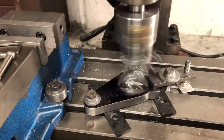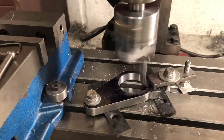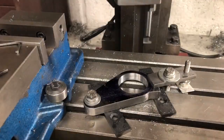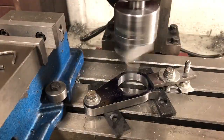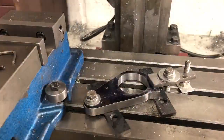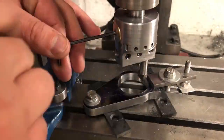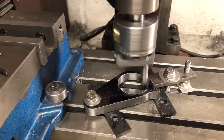As we get closer to dimension, the bore is checked with a telescoping gauge after taking a spring pass. The book calls for this part to be completed first, with the view that the spigot diameter on the casting would be machined to fit the bore. I decided I would find hitting the dimension on this component easier, which is why I have left it until now. Once I hit final dimension, I swap the cutter out for a countersink and put a generous chamfer on the edge.